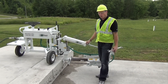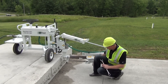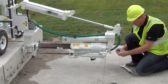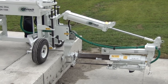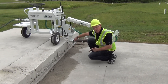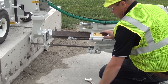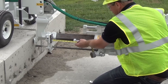Now we want to look at how to set the depth of the hole that we want to drill. We have our stop rod here and the stop pad, but we need to get the drill steel and the drill up against the slab. So we want to remove the pin off the back so the drill can slide on the rail, and then we actually want to feed the drill into the slab. Now that the drill steel is up against the slab, this measurement will be true. If we want an eight inch hole, we need to move the stop guide up to the eight inch mark. So we need to loosen the jam nuts, slide it forward to eight inches, and then re-tighten the jam nuts in the correct position.